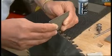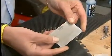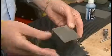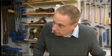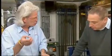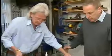Use the fine grit for this. When working with carbide, unless you've got a really messy saw blade, you can see how quickly I'm beginning to remove the carbide. Work around the saw blade two or three light strokes on each tooth all the way around to put the edge back on. I'd suggest sharpening it yourself about three times, then on the fourth time send it away to be precision ground. Interim sharpening will prolong the life of your saw blades tremendously.